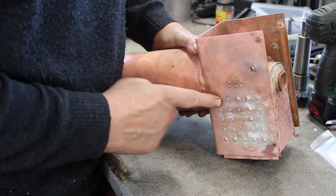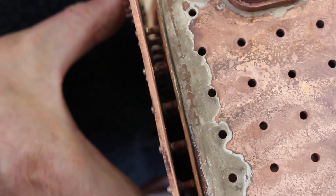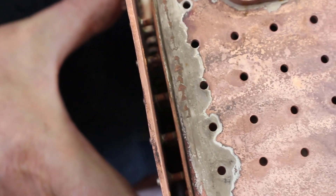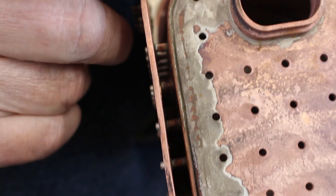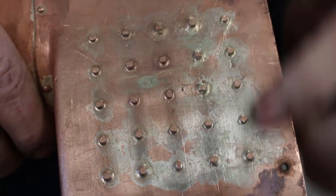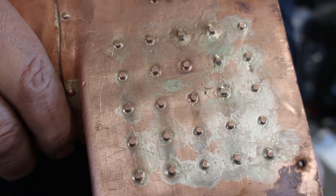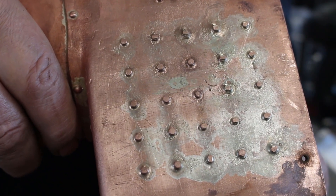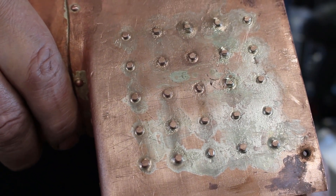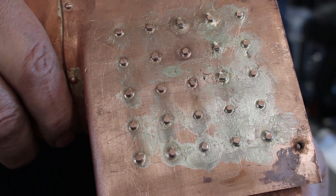I've also gone ahead and done some of the stays, and looking down between the firebox and the side plate I can see a fillet on both sides of every stay, so that's looking pretty sound. A little bit of overspill of silver solder on the outside but it's flat and I think it's okay. It's not brilliant but I think it's sound. This is not an easy job — takes a lot of practice. I'd probably need to build two or three boilers before I could get really good at this.